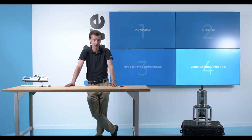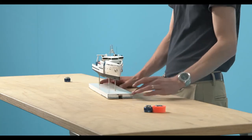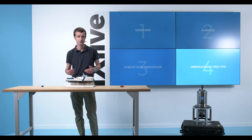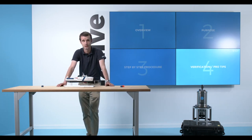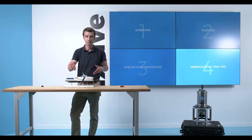The less motion of the ocean there is, the better it is. So of course you plan your calibration day when it's nice and sunny outside, so that at sea you have a smoother trajectory. A second calibration run is not necessarily necessary, but I would advise it sometimes, if you have any doubt: just run a second calibration run, starting from the previously computed values. So you would see if you stick to those values or if those values change again. It would indicate sometimes you have to restart the DVL calibration. Of course, if you know there are strong currents in your location, the use of an SVP, a sound velocity profiler, is more than advised, because it will compensate the beams of the DVL.